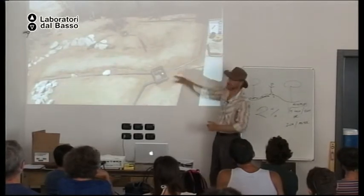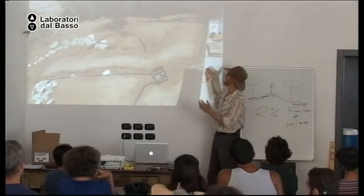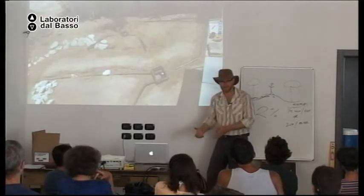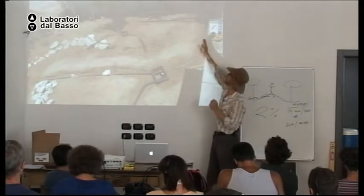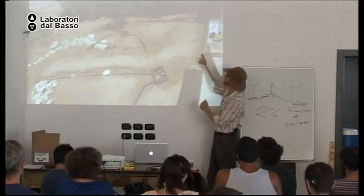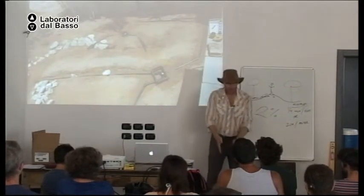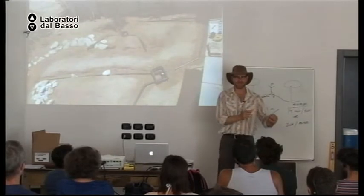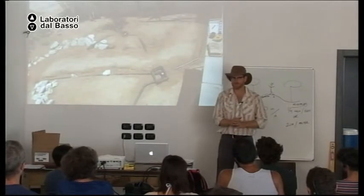I also dig my trenches deeper than necessary, because it's easier to dig a lot at first instead of having to take the pipe out and dig again. Then when I fill in the trench with dirt, I fill in the sides, pack the dirt alongside the pipe, and I measure again. And if everything is good, then I bury it.